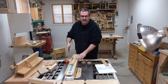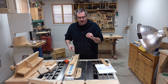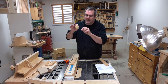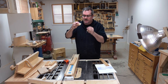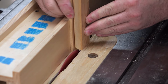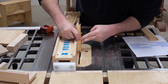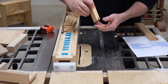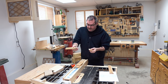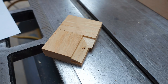I've moved the fence to the other side of the blade, brought the blade back up to 90 degrees, made a sample cut, and I've taken my other scrap and broke off the back part so that just the angled piece can go in and I can check the fit. I'm happy with the fit — it goes together perfectly, and that completes that part of the cut.